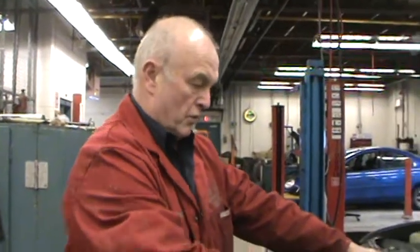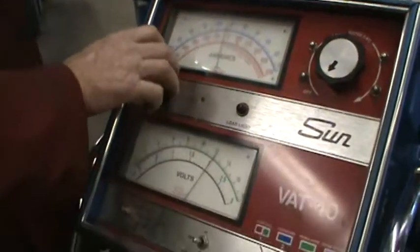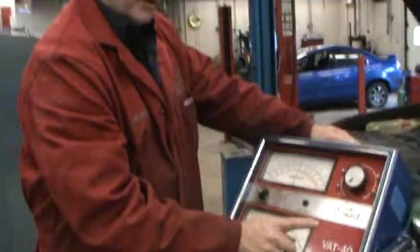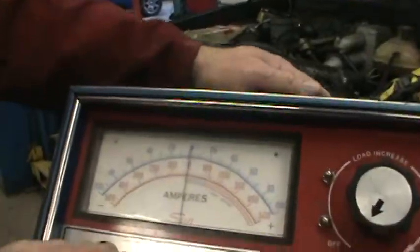We now have a voltage reading. We see that everything is zeroed — the meter gauge is zeroed. We could change that if it wasn't; we just turn the zero button. The scale switch should be on number two, and you see that changed the zeroing, so I'm going to zero it again.